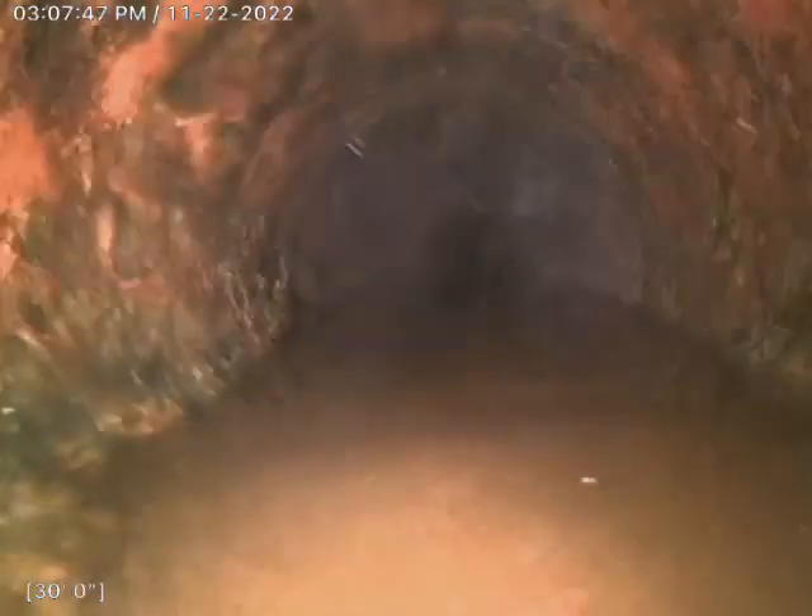And we get into a belly here at about 31 feet. We pop out of it a little bit past our transition from clay to cast. You can see it up there — about 30 feet from the roof vent.